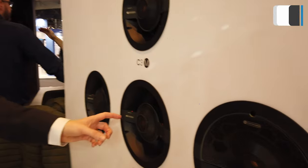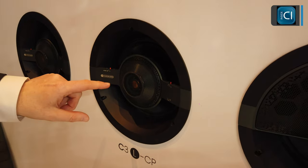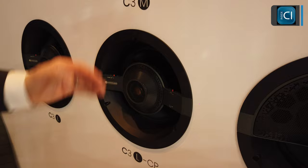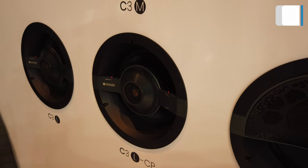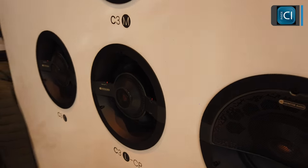The other new product here is the new IDC2 mid-range tweeter system. We've got this dual concentric array that sits inside the bass driver, giving us a three-way in-ceiling loudspeaker. This improves both the directivity of the system and refines the mid-range in a way that three-ways can, delivering that performance tier. These all have aluminium cast centre sections and are available in CP and open back. The in-wall unit we only offer as open back, but we offer an MDF rear box for it.